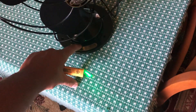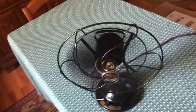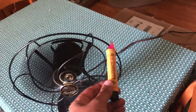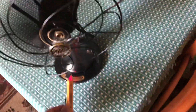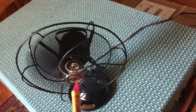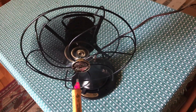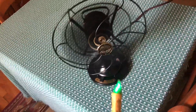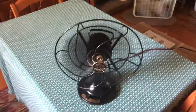Now watch this — we're going to power the fan on. Watch as I touch it all the way around the fan. Now I would understand this thing picking up voltage if you touch it against the motor and the base where the switch is located, but not out here on the outer portions of the guard. Like I said, I know this thing shocked me because I was kneeling down touching the bench after I buffed it up and put it back on the fan while it was actually running, just to run it in a little bit — and it freaking let me have it pretty good.